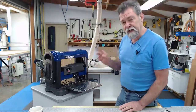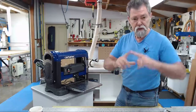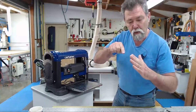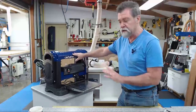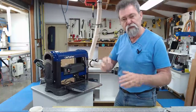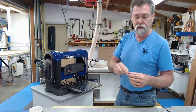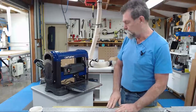This one, if I nick anything, each blade has got two sharp edges. Now it's a square. So we've got this square and two of the sides of the square, on one corner, has a dot. Now I'm doing a review on this machine because I know the machine backwards. The dot says I'm sharp either side. The adjacent sides are actually blunt because they push back against the head. So that gives it its strength. So you're not relying on the screw to hold it in totally. It's held down by the screw and also by the ridges on the head.